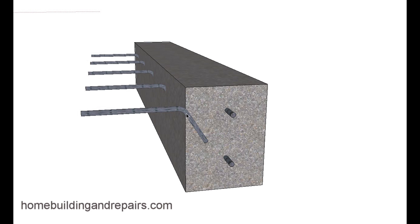I don't know how well it will hold in a large earthquake, and the same goes for the angled dowels — if there's a large earthquake you're going to have severe damage to the building anyway. The reason for drilling at an angle is to provide a little more strength if you aren't going to use epoxy. I did talk to an engineer and he liked the idea of drilling at an angle and started to recommend it on future projects.